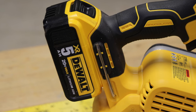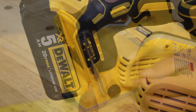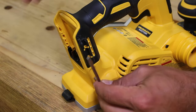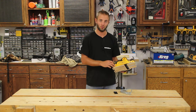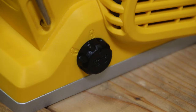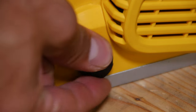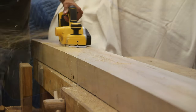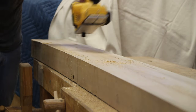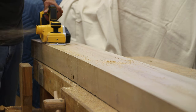On the back of the unit there is an allen key with a nice little storage spot so you don't have to go looking for one on the job site. Also very handy: there are two blade storage slots on the back knob. Turn it counterclockwise and it opens a storage port for two additional blades. So if your blades get dull you know exactly where the replacements are — switch them out with the allen key and the plastic blade setting device, order a couple more blades, put them back in storage, and you're ready to go.